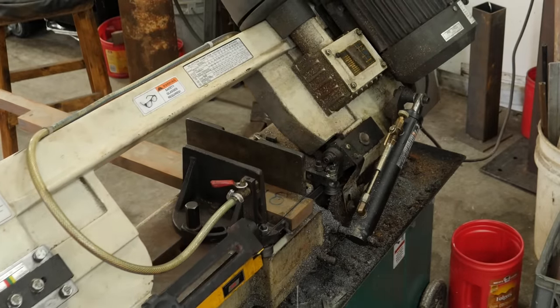Now that the gold inlay is done I need to add a few more grooves that go across in the same angular pattern that don't have any gold in them. The engraving on the pommel is done — next I focus on the guard. The guard will be slightly different: I want to add XCow's logo into one side of the guard and inlay it in gold. I had a custom XCow logo stencil made up and I electrochemically etched through the stencil. I could have laid out the logo by hand but I thought it would be much quicker to have a stencil made up, electrochemically etch it so I'll have a good mark, and then cut it out and engrave it deeper for the gold.